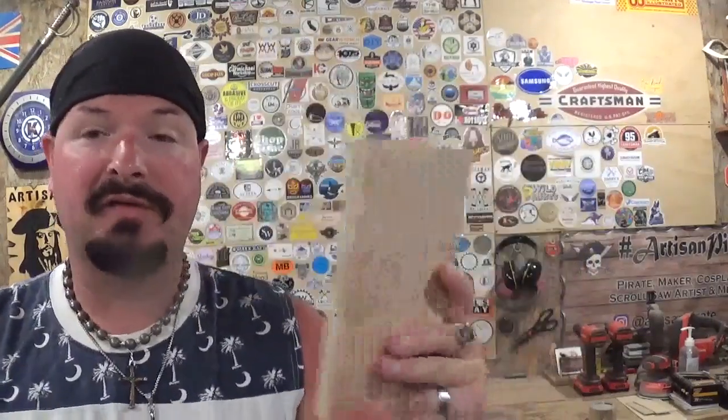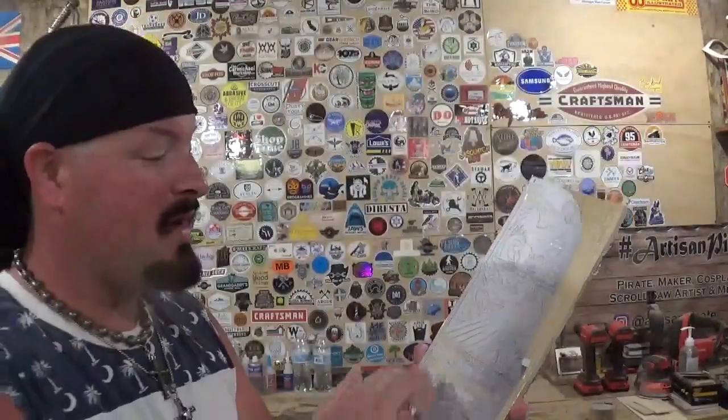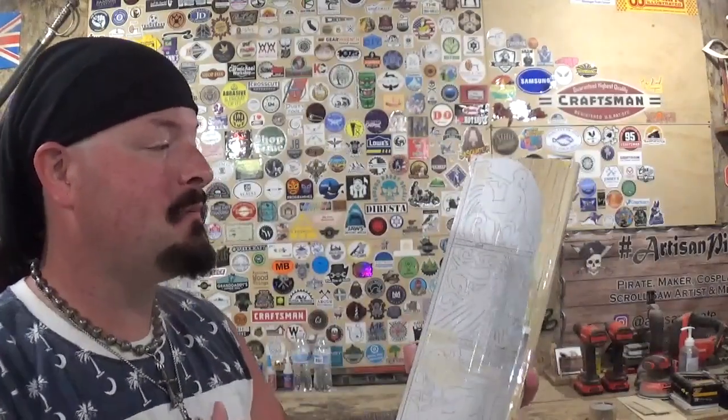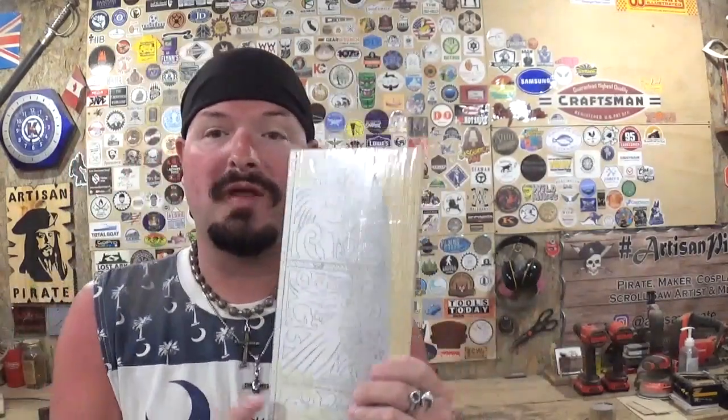The pattern needed to be enlarged to 170 percent, so I took it to the local copy place. I've already got the pattern prepped and attached to the material with clear packing tape. It is one-quarter inch material for everything in this project. There will be one small shelf at the top and then two larger shelves below — three shelves in total. It ended up being a two-page pattern that I cut out and lined up. I ran the quarter-inch plywood down the table saw to get a perfect flat edge for assembly into the corner.